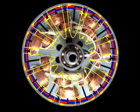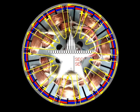On the fourth quarter of the wave we have the arrows showing the flux going in a negative direction through the inner coils. These arrows run flux in a circular path through the induction ring or magnet ring on the outside of the magnets. The arrows go through one magnet to the magnet ring and back out the other magnet — this is like stacking two magnets, making each one twice as strong. So if your magnet ring isn't thick enough, it's not conducting the magnetic flux of the two magnets well, and you're not getting the full power of your magnets.